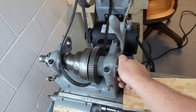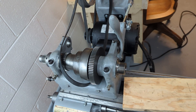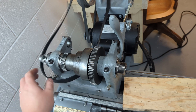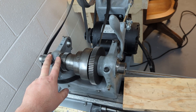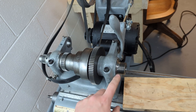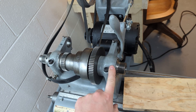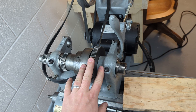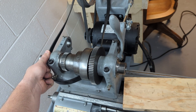And that's it. Now the felts are up against the spindle to keep it lubricated. That's how you install the spindle onto the headstock of the South Bend Model 9A. I'm going to be making a separate video talking about how to adjust the actual bearing tension on your spindle — there's a procedure for that, and as well for getting a good tension on this locking collar at the back here.